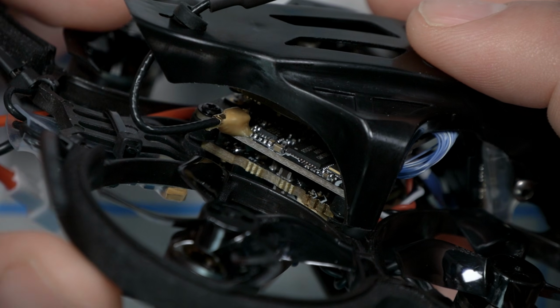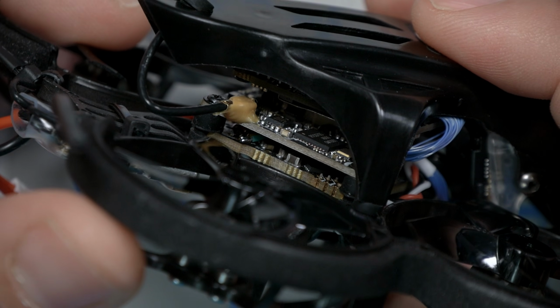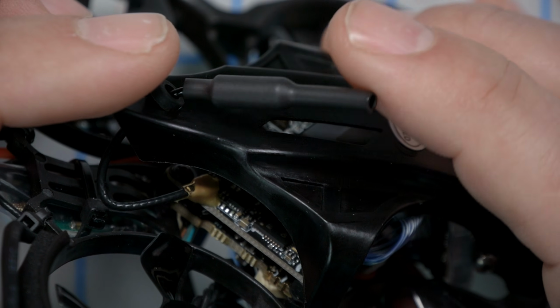The video transmitter on the TinyGo goes from 25 to 200 milliwatts and no more. You're probably going to get acceptable range on 200 milliwatts. On 25 milliwatts, the smaller quads really suffer. And it comes with a little dipole antenna, not a fancy circular polarized antenna.